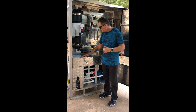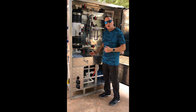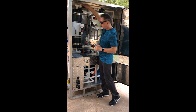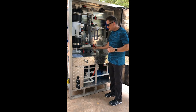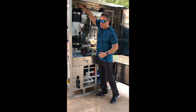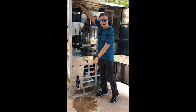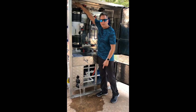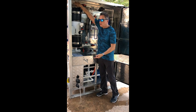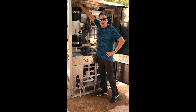The process for draining is shown on page 10 of the manual. First, we open valve number 1 up here, then we open valve 8. The next step is to push the air release valve up here, and once we do that the fluid will start to exit the filter from the back flush valve on the bottom. You can hear the air coming in through the top, and we need to hold button valve 16 until all of the fluid exits the filter.